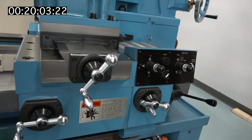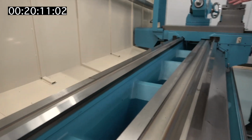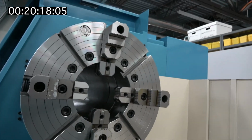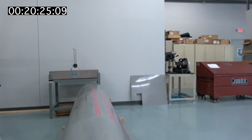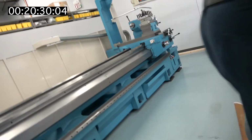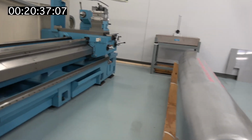So you can turn the taper or straight or counterbore with some features. A lot of times people going manual do a machine like this, a long shaft, a large diameter shaft, kind of like what this is right here behind you, and they're going to do threading on one side. So you have to swallow that part in that chuck. It shows you what the swing, the diameter of the swing, is. It is 750 millimeters, about 30 inches, 28.